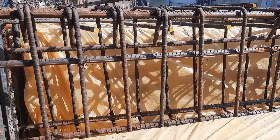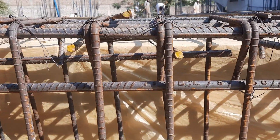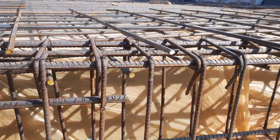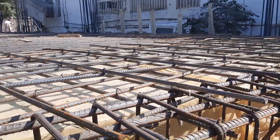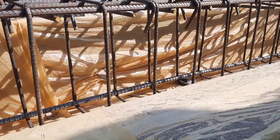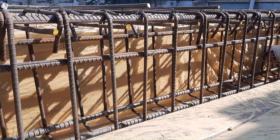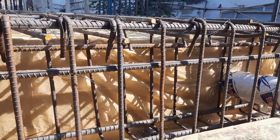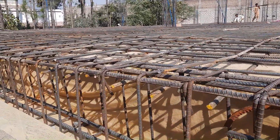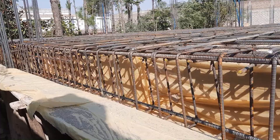I have done more videos on this construction site where I will guide you for simply supported beams, cantilever beams, as well as steel reinforcement and construction of the slab. You can see clearly the steel details in this short video — extra steel rods for the L/4 distance to resist negative bending moment. They have a good site supervisor and a good steel fixer, so they have given good results. Hope this video can help you. Thanks for watching, see you in the next video. Goodbye.